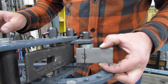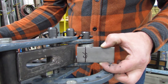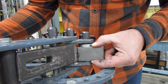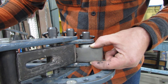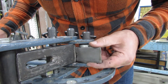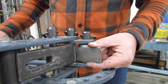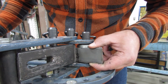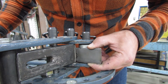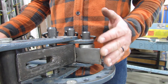I'm going to slide this piece into the bender. I've got my arm basically all the way counter-clockwise so it's easy to slide my work piece in there. Keep your eye on the Sharpie mark and I'm going to start to turn the handle clockwise. It's going to tighten up on my work piece. What I'm trying to do is get that Sharpie line to be completely covered up by the bending plate, but I've got to be square. I can just see the edge of my Sharpie line, and then I tighten up by turning the handle clockwise. Now my work piece is nice and square in the bender and I can begin to make my bend.